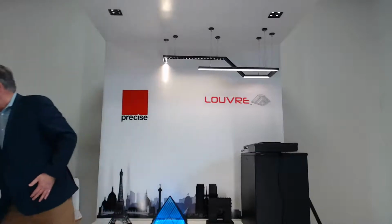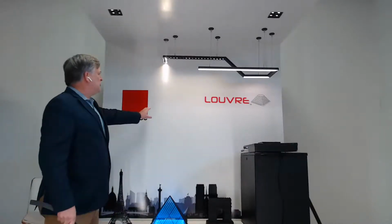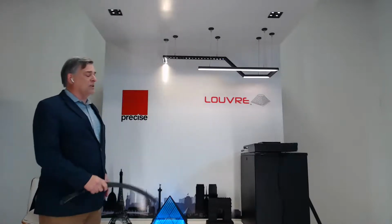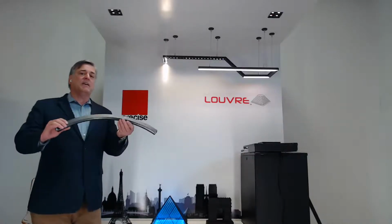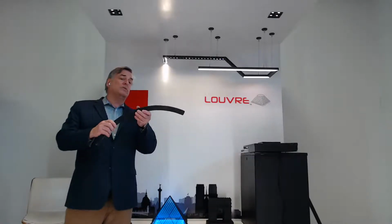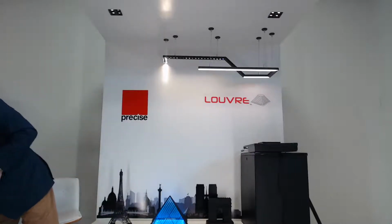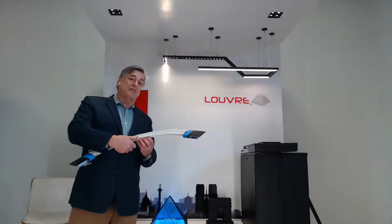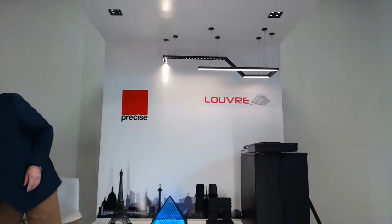Is this another Midwest? No, I have one from, that was the Southeast. I have one from the Midwest. It's, can the Zen Light products transition to and from recessed and surface and pendant in a single run? Great question. Yes, indeed. Zen Light can transition from recessed to pendant in this case, and can actually become surface mounted. This is an example of the channel that would be used for 1-inch Zen Light, and this would be pendant mounted or surface mounted, and it would meet up with the mud-in version. So the lenses are all the same. It's the body of the fixture that's just different. Thanks a lot to the Midwest.